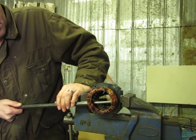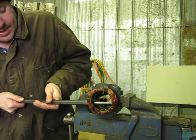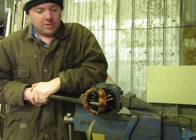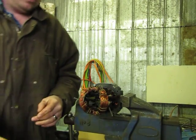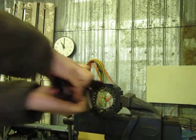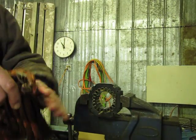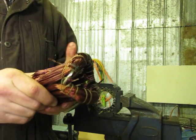You see where the smaller windings go through the core. Give it a pull one way, pull the other way, a little bit more — usually you can just pull it out with your hands after this. And there you go: there's your copper windings out of that iron core.